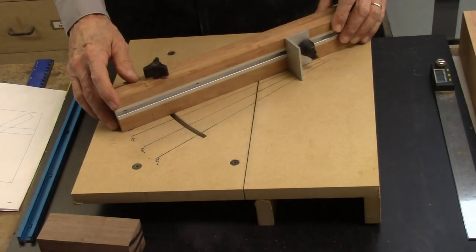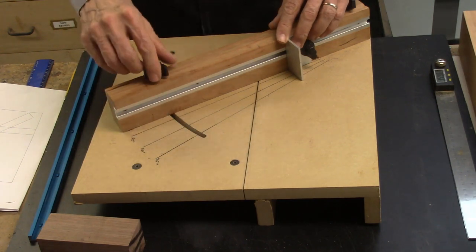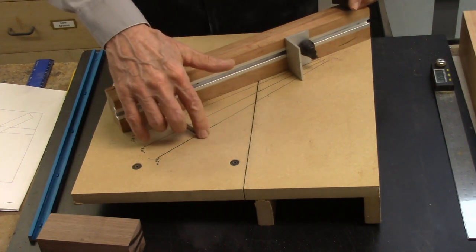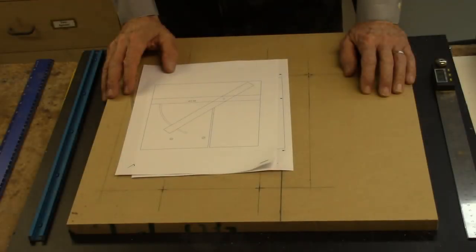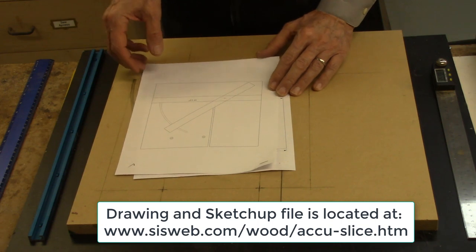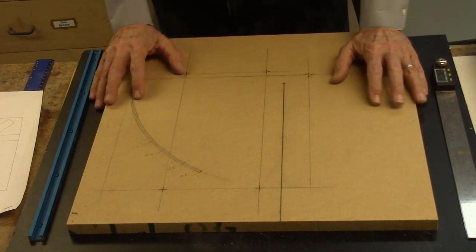This is a prototype of the Celtic ring jig. It consists of two main components: a main table with mounting holes for either the miter bar or the AccuSlice flat plate carriage, and a curved slot for adjusting the angle of the fence. The fence has a pivot point hole and a second hole for a carriage bolt that slides in the curved slot. The design was laid out in SketchUp — the SketchUp file and PDF drawings are available for download from the AccuSlice Literature tab on the website.